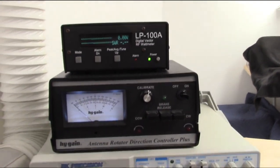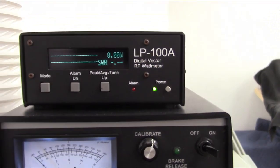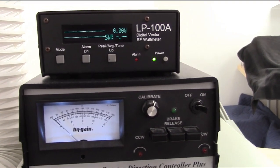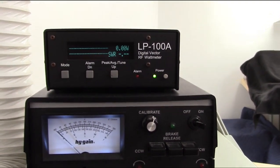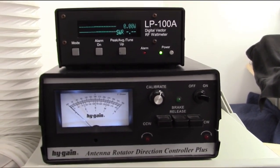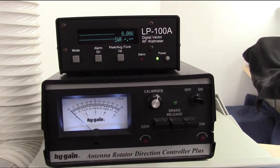So with that said, when I key up here, this went up to a 1.6 on channel 28. Now when I kicked the last stage on, we dropped down a little bit to maybe like a 1.55, so I wasn't too worried about it. So yeah, it worked. It was what it is, but it worked and got me on air. And so all right, let's try this out here.